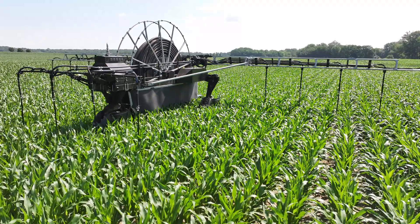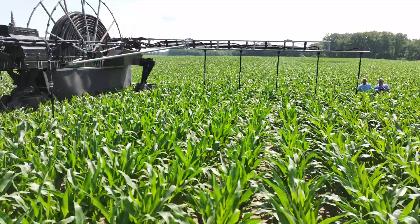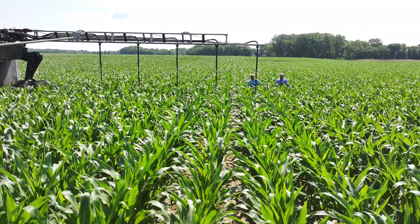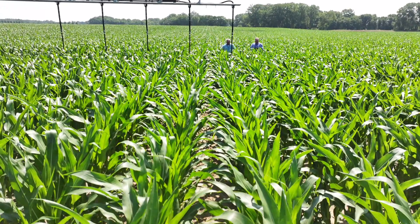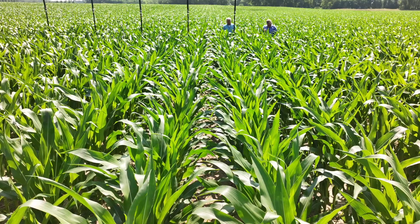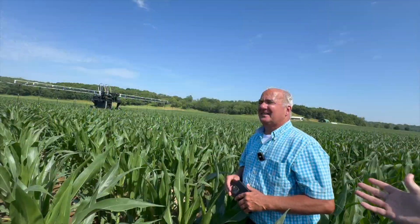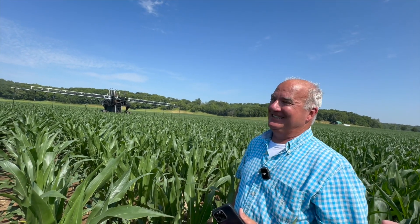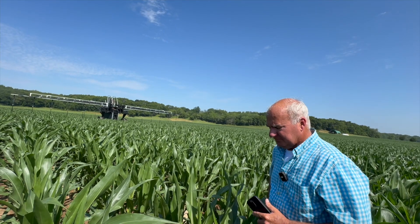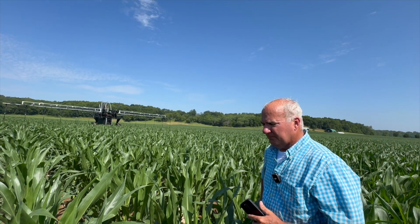If you're watching this video and you're thinking this is interesting, here's the elevator speech about how many acres one machine can do. Some guys are thinking, maybe instead of upgrading our four-year-old combine, maybe we ought to try something different to find 50 extra bushels. There are some limitations — what does one machine really cover with 3,000 feet of hose? The reel is 26 inches wide working a 30-inch row, so the max is 3,000 feet of three-inch hose. By design I want it to be able to do up to 200 acres depending on field shape — if it's a perfect rectangle I'm doing 230 in one of my fields.